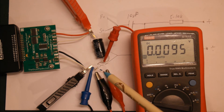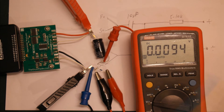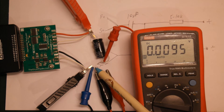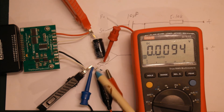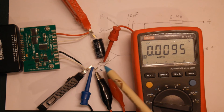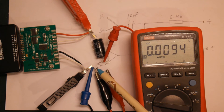So what we're going to try and measure here is a small capacitor — a 1206 package, 10 microfarad ceramic capacitor rated for 10 volts. We want to test the capacitance at zero volts, at 3.3 volts — a common use case for decoupling a power supply line — and at five volts. This measurement is actually quite useful to have a bias voltage for, because ceramic capacitors tend to change capacitance depending on the bias voltage.